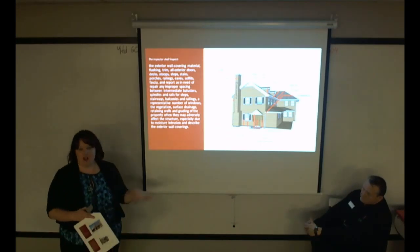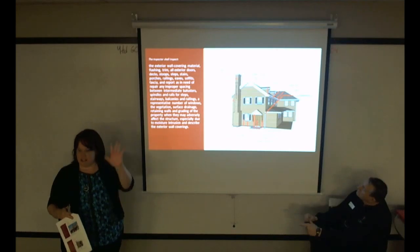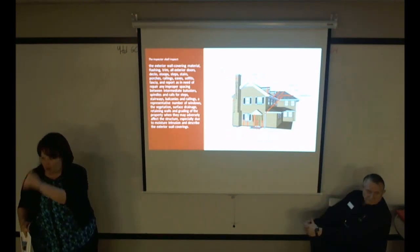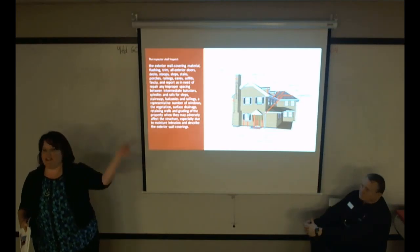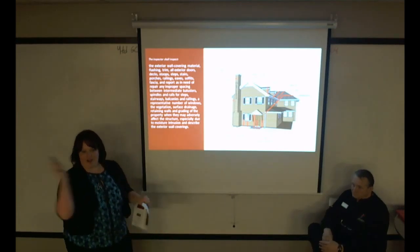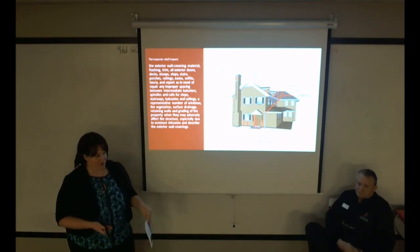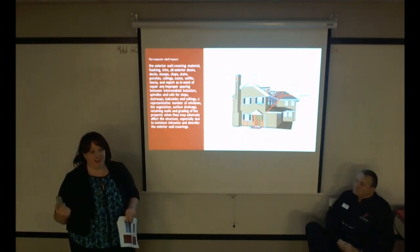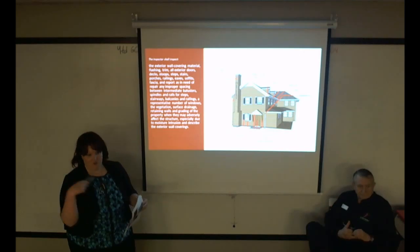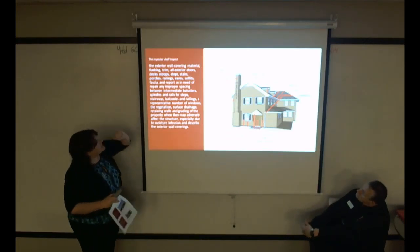When learning to do inspections, my brother — our lead inspector and a longtime contractor — walked me around the property slowly on an older 1970s home. After the first walkthrough, he said that's not how you inspect the exterior. Now we walk around the other way, because you'll see 5 to 10 more things going the other direction. A client walkthrough gives the inspector another opportunity to catch things they missed.